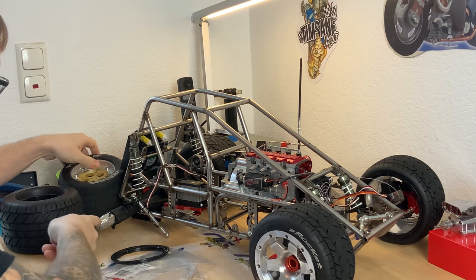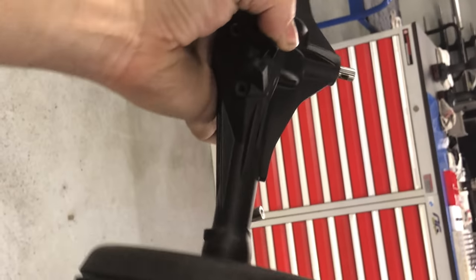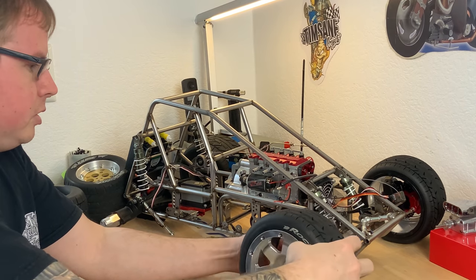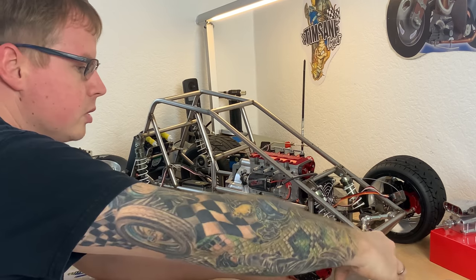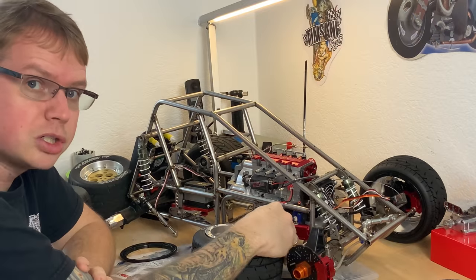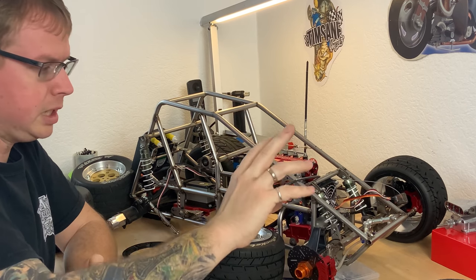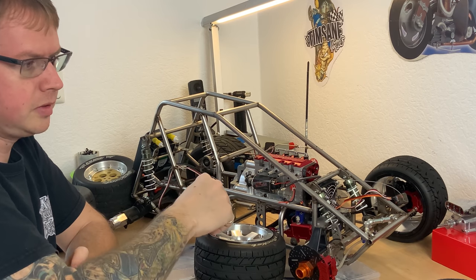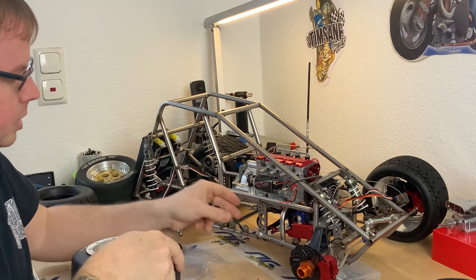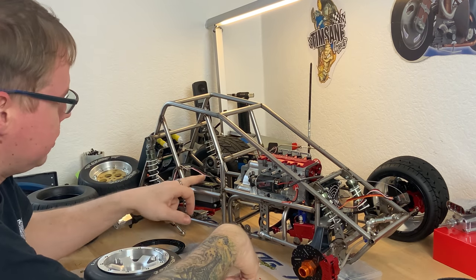I'm using a different mounting method, which meant I had to build special adapters for the rear axle. My plan was also to install disc brakes in the rear — I already have them in the front. This is a hydraulic disc brake setup, normally used in the Baja. After making first tests with the brushless motor, it was obvious I can use the hydraulic disc brake setup for the front and have a completely independent brake setup for the rear axle. The rear axle is braked with the brushless motor — fully programmable — and the front is braked with the master brake cylinder via a servo and a long push rod.